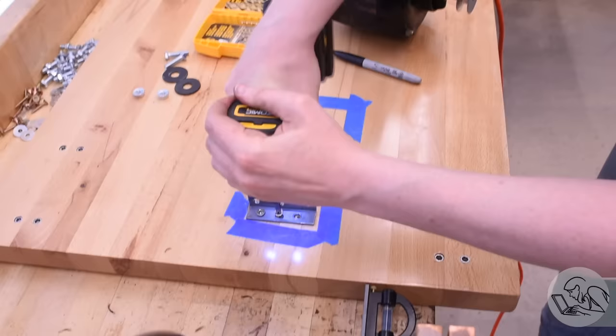Here goes — I'm going to tension the belt for the first time and see if this actually works. The belt looks pretty well centered in the slot, it's not rubbing anywhere. Firing it up... seems okay. Nothing's rubbing, the belt seems to be running straight and it seems happy. I'm going to go ahead and mark this position for the die filer. I think this is going to be the spot. Using large wood screws to hold the die filer down — honestly the die filer doesn't need much to hold it in place; the thing is so heavy and doesn't have a lot of tension or forces on it even from the belt, but some big wood screws will be more than enough.